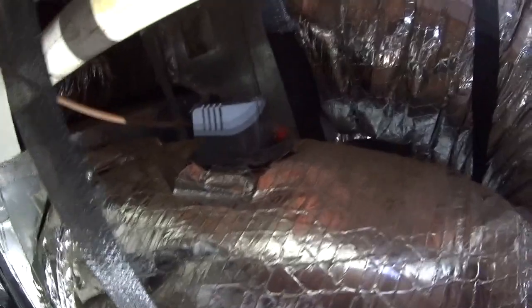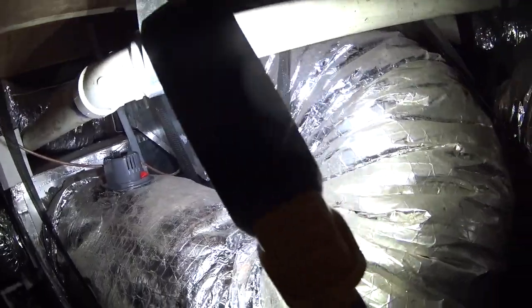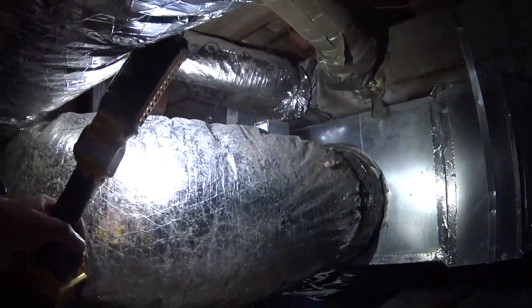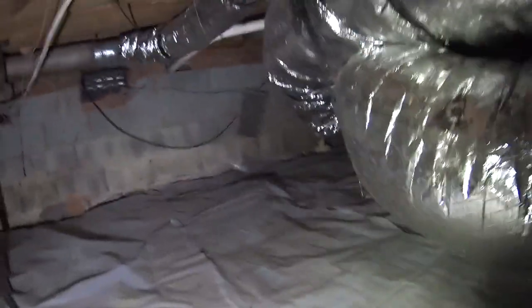They did have a damper motor put in recently, and my assumption would be that this is the one that they replaced, because these damper motors would not look like that for this particular system unless there's a damper on the back, which should have also been the old style. Let me see if I can get back there. Yeah, so I don't know if you can see it very well, but that damper motor is also the old style, and so the actuator that was replaced would have to be that one. My concern is maybe they picked the wrong damper motor, but I'll have to double check with the customer.